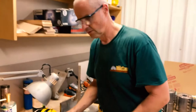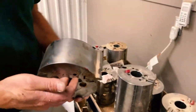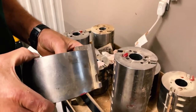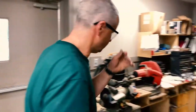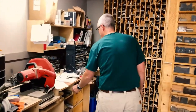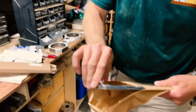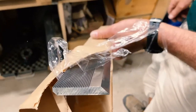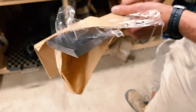From here we are going to put steel in a head — these are our heads that grind the profiles. We put this corrugated steel into a head; the head goes on the grinding machine, which you'll see in a few minutes, and we cut the template and turn it into a knife. The corrugated steel comes in 24-inch long bars and the corrugation allows it to fit securely in those heads. It slides into a head that has the opposite corrugation on it and they lock together so the knife can't come out.